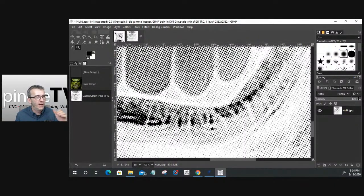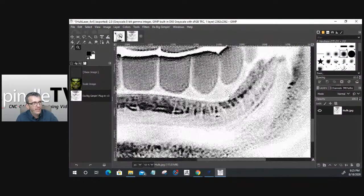I want it to ride at that 10% more so than cycle from 0 to 10. I want it to ride at that 10% all the way through. Now in Vectric, I could have my maximum power at 10% and my minimum power at 10%, so it doesn't cycle. It stays at 10% all the way through. And that would help dramatically, right? That would help maintain.